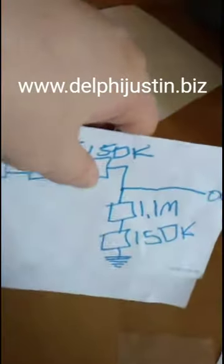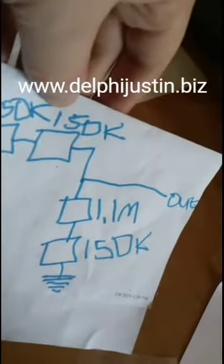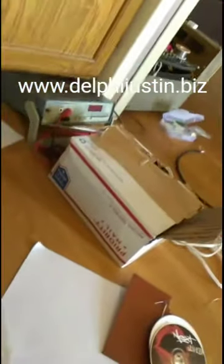They add up in series; in parallel, they decrease. It's hard to explain, but you total the reciprocals of the resistors in parallel, and then take the reciprocal of that total. But we're not going to go over that. You can look up series resistors and parallel resistors on the internet. They'll tell you more about that, and the math behind it.